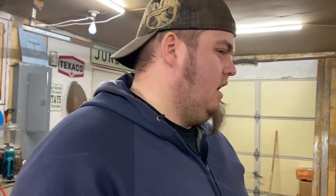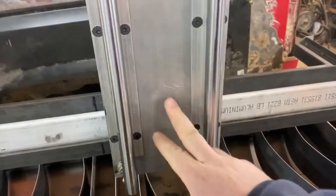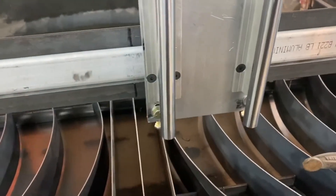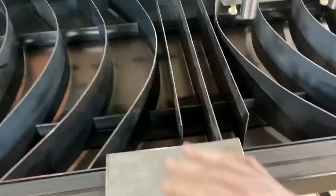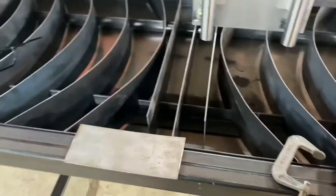What I'm going to do is try using this dial indicator and run it along the edge of the table, around the frame, and mount it to this guy so I have a fixed spot. Now this is aluminum and this has a magnetic base, and magnets don't stick to aluminum. So I'm going to try to clamp a chunk of scrap steel around it. I used the last two of my c-clamps and found out that one was all cattywampus. I'm going to try clamping down that piece of steel, mount my dial indicator, run around the table and see how close we are, and if we're close I'm going to mark where the gantry is and drill some holes.